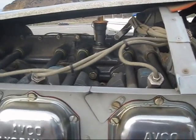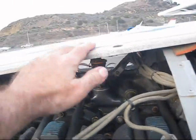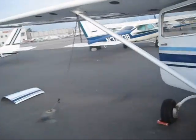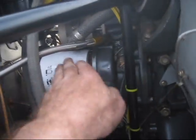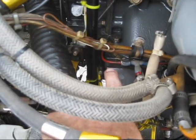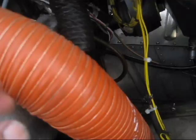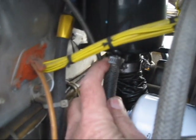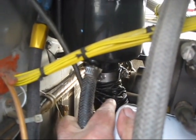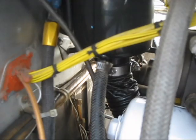We have eight quarts of oil on the engine, and I put back the oil filler cap so we can close that access panel. On the other side I've safety wired the oil filter — it's right there. I've safety wired the oil screen which is way in there, and I've also safety wired the quick drain plug right here. I put back the heater hose, that's tight. And the hose for the oil-air separator is back on, along with the hose behind it. We're good to go — we just have to start the engine and check for any leaks.